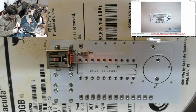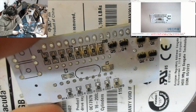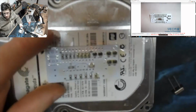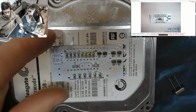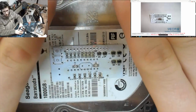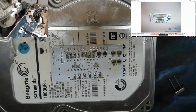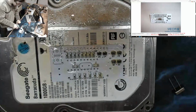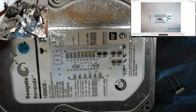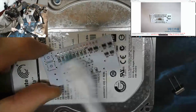We've got to put our oscillating crystal on now. So we're onto through-hole stuff now. So I might just clean up the board at this point, because we shouldn't need any more flux in here, and that means that I can just get the nasty flux out of the way. Flux is carcinogenic. It's horrible stuff. So it's nice to not be dealing with it when you can. Right. Alcohol time. Cleansing alcohol. So this is isopropyl alcohol that I'm spraying onto it. And we'll just clean down that board.